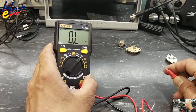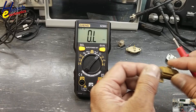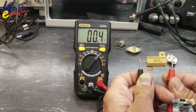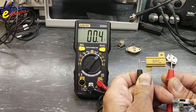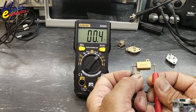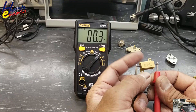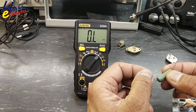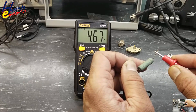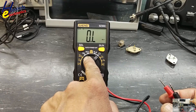Then resistance: test lead error is approximately 0.1 ohms. Checking a 0.24 ohm resistor — it shows 0.4 ohms; minus the 0.1 lead error gives 0.3 ohms, which is within range. A 0.196 ohm resistor reads 0.3, minus 0.1 error = 0.2 ohms, that's good. Testing 4.7K 5% resistor, and a 28K resistor shows 28.2K — good. There is no temperature measurement function.